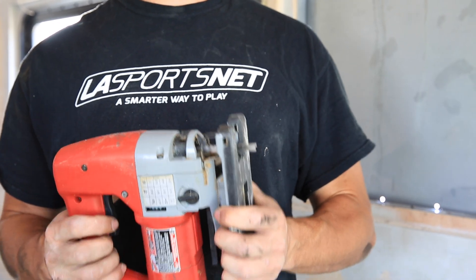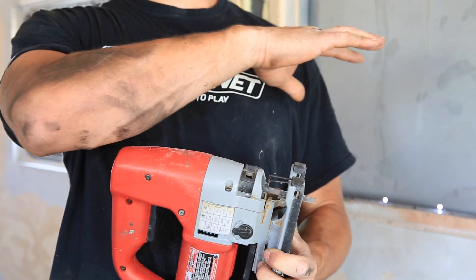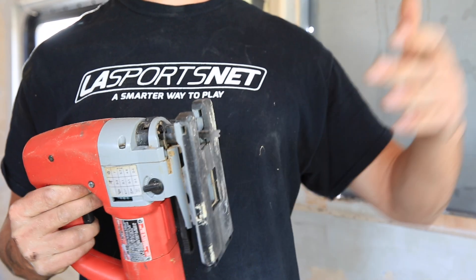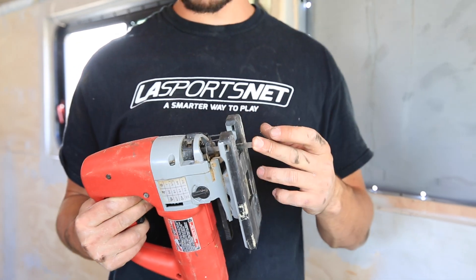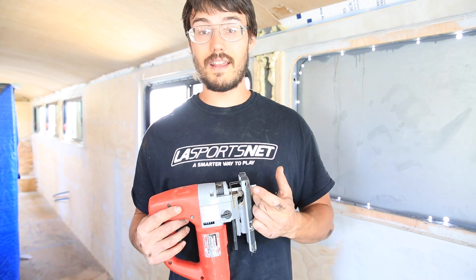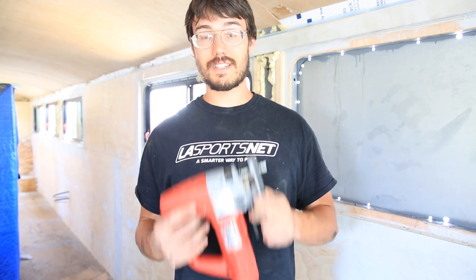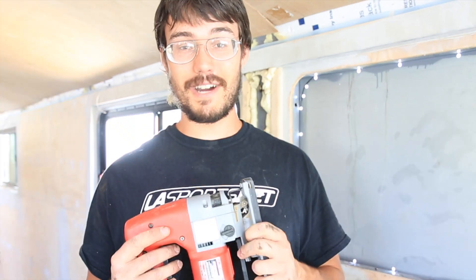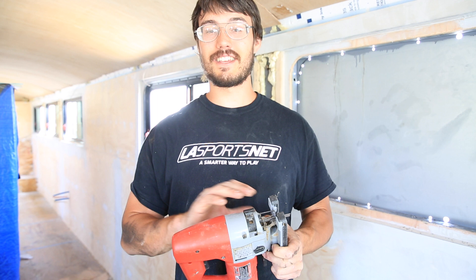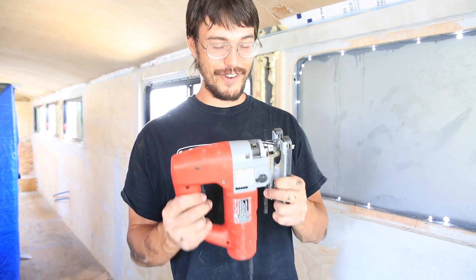The problem was, every now and again the blade would pop out because of differences in the surface of the metal outside, and then the blade would buck the jigsaw and hit the metal. All of a sudden it would break somewhere along the blade. I went through two packages — two five-packs — of jigsaw blades, cursing the whole time, wondering what I was doing wrong. I tried changing the speed settings on the jigsaw, the orbit settings, I was trying all sorts of stuff, but they just kept breaking. It was so frustrating.